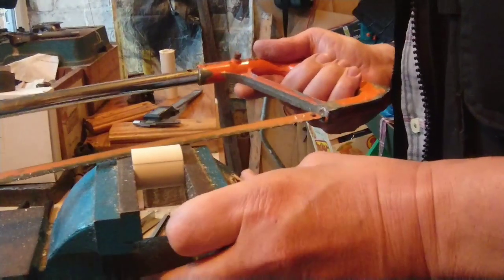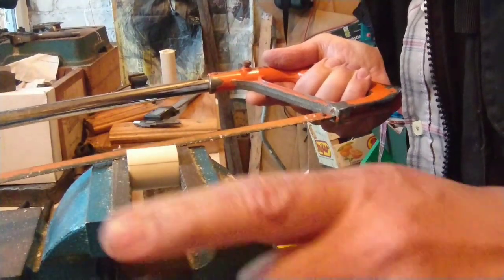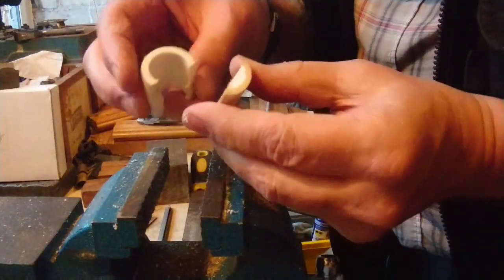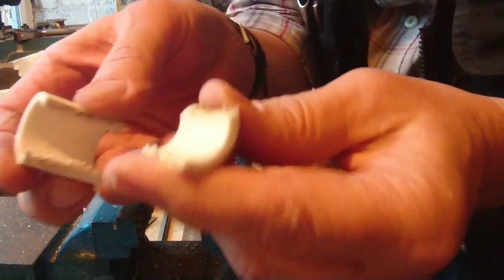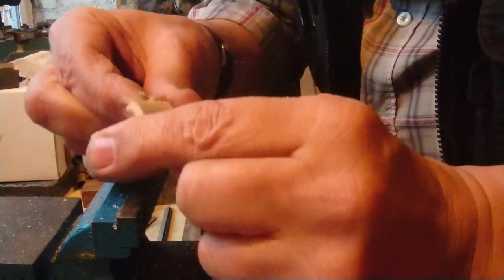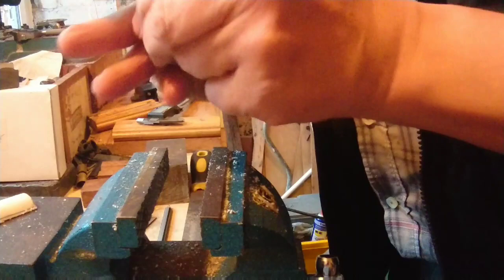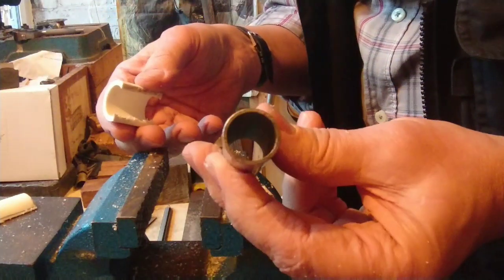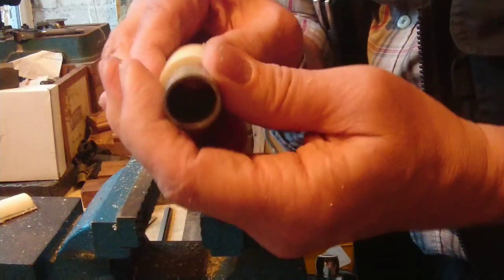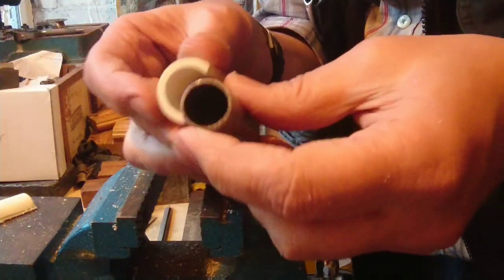So I'm going to save time — last time I had to file off the angles, this time I'm going to cut at an angle and get chamfers automatically. I'll just cheat and use the surface of the vice jaws as my guide for sawing. Here is the result of my sawing — there's still burr on it from the saw but most of it will just brush away. The waste piece is set aside, and it looks like I've got it about right because when I use my flute substitute tube you can see the shape and that's going to clip on there quite nicely.